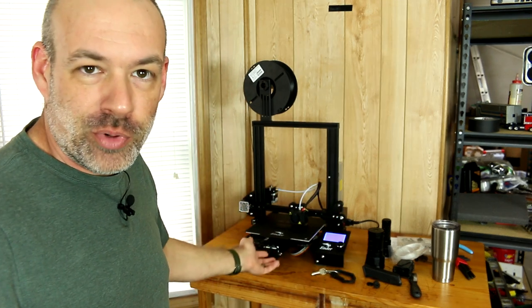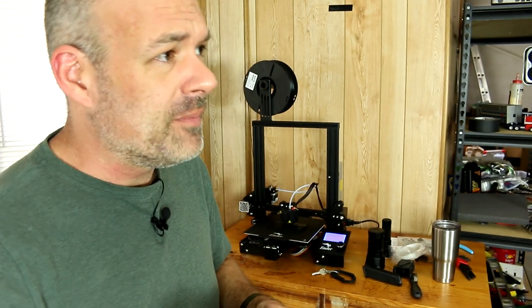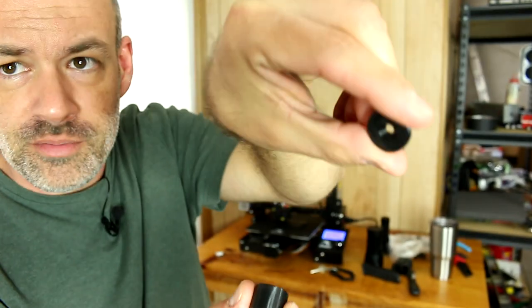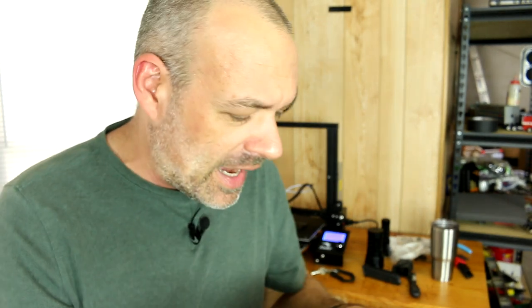But for little one-off ideas and small shops like what I've got, a little cheap 3D printer works beautifully. They're also super helpful for getting just real small, tiny items that you need on a daily basis. Like right now, I needed some standoffs for my peg boards that I'm hanging because I've got a new shop covered with peg board. You can put up little blocks of wood because you do have to stand off the peg board from the wall or you can't get your hooks in. I found a US supplier and maker of peg board hooks — they're so much better than the Chinese copies. I printed up some standoffs here — a washer and a little 10 millimeter standoff. The screw goes through the hole in the center, it works perfectly, and each setup cost about seven cents to print off. It took five hours to print a whole bunch of them, but it cost me like seven cents to print.